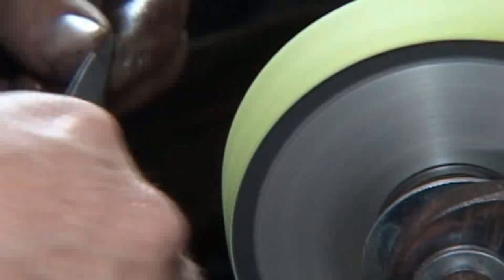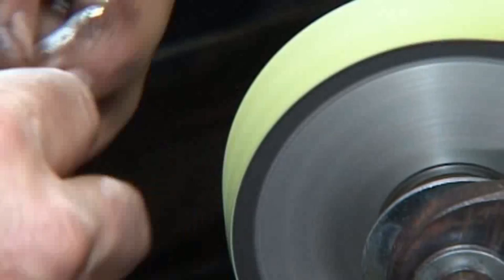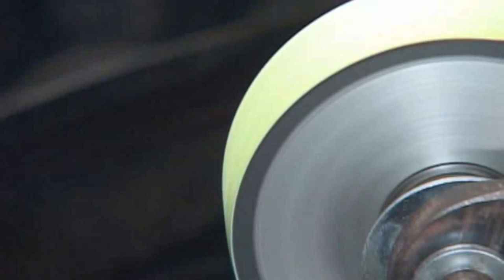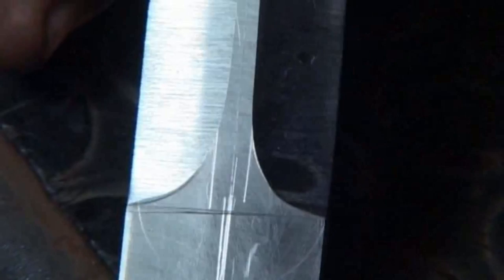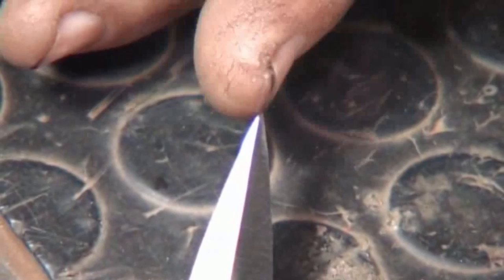All right, here we're pretty close. Okay. So, essentially that is quite neat. Those plunges are not all raggedy, they're smooth. I'll move the knife all the way down the blade, one bevel all the way through to the tip. See that it comes out at the tip almost in position. See that it's slightly off. But to try and grind that is really difficult.